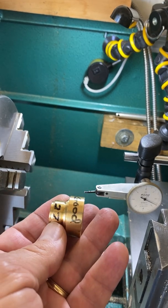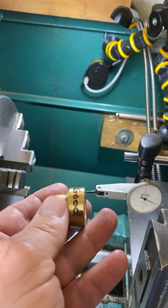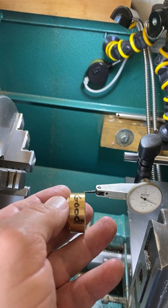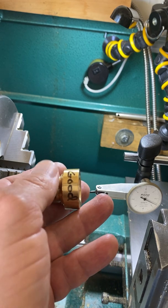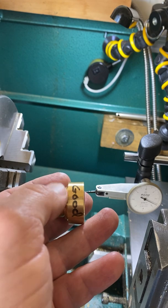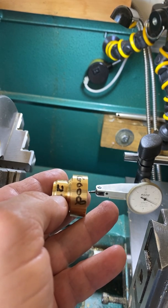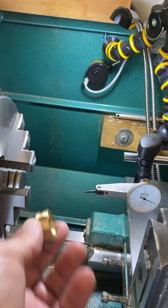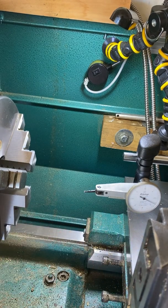See how there's a flat spot right here? You need a flat spot to make it easy to get into the chuck, and almost all mouthpieces made now have the flat spot in this area — that's how it was gripped in the chuck when it was made. Some old mouthpieces, like old Bach and Burt Herrick's, are hard to get in the chuck because there's no good flat spot. This is going to be an easy one, so I'm going to stick it in and show you how to use the indicator to tell if it's perfectly straight.